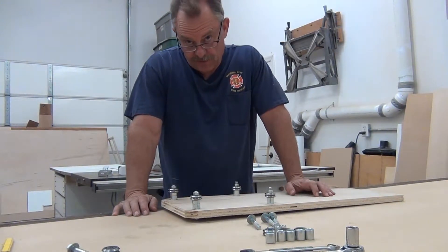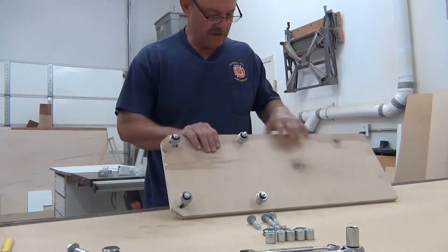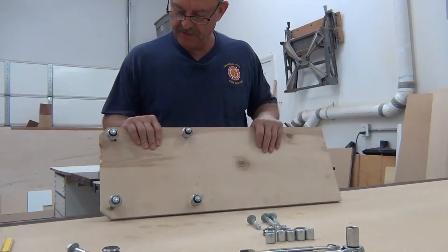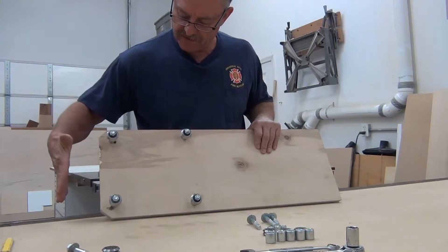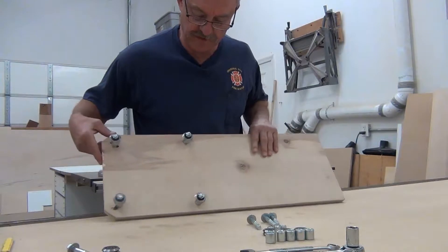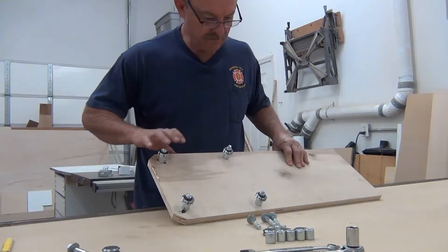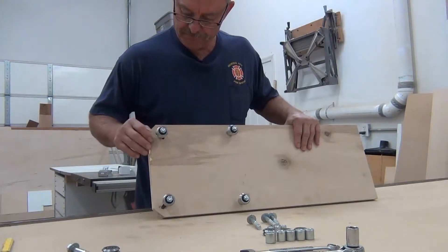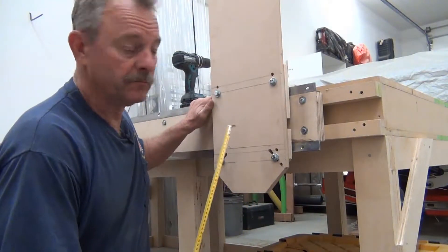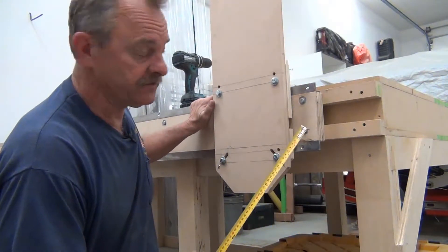Since I'm an experienced woodworker and I've made many mistakes before, I'm going to use this piece I've already got to make a template first, to make sure it's exactly right. I want to make it the correct length, cut my 45s, create my slots for adjustment, and put barrel nuts in so I can use the screw for the adjustment mechanism. Then I'll do the real piece.